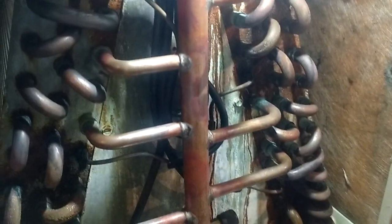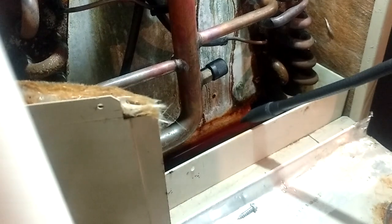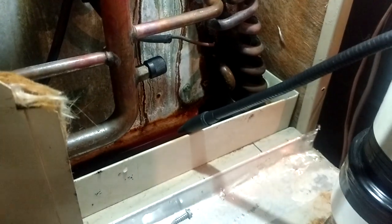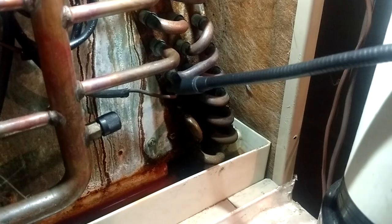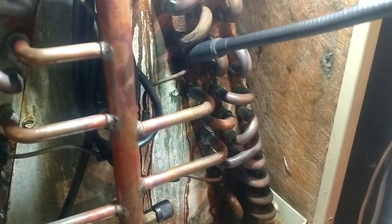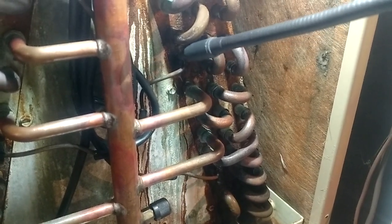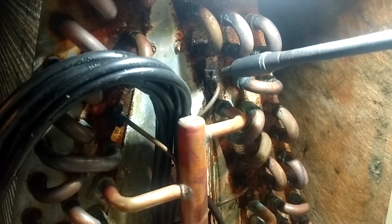I got a tiny little something there, but I'd say a lot of this refrigerant has settled down in the pan. There's probably some oil and stuff down in there, but when you just get a tiny little beep like that, you know it's either an extremely small leak or just some trace something floating around — not really anything massive to worry about. Then right there is another feeder tube down there and we're not getting anything there. Back up here, that one's leaking, and our bigger one was up here — a good solid tone on that one.